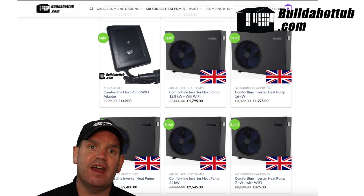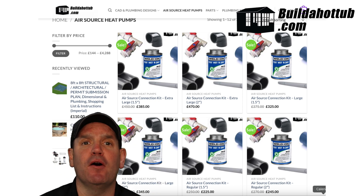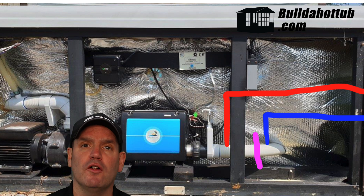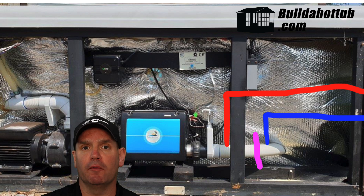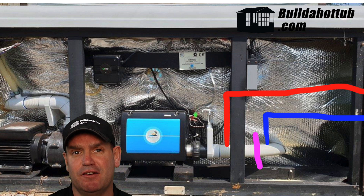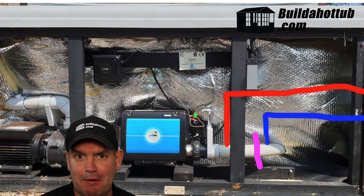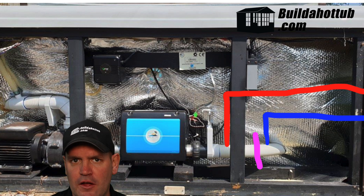We also selected the one and a half inch regular connection kit that I have on the website. From the site, you can get not only the air source heat pump but everything you need plumbing-wise to add that to your tub as well — you can see that behind me here, and I'll put a link underneath this video. What I tend to do is mark up a picture of the hot tub internals: the blue lines go to the cold input on the air source heat pump, the red comes from the hot output, and the pink is where you're actually going to cut into the pipes. Even such a rudimentary drawing like this just makes life a little bit easier and gives peace of mind that you're putting things in the right place, in the right order, with the flow going the right way.